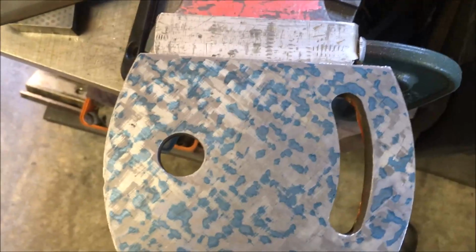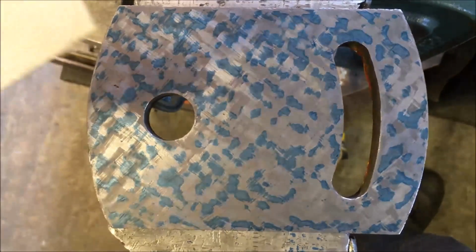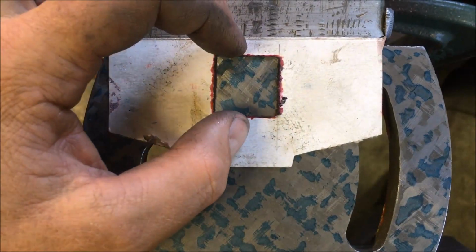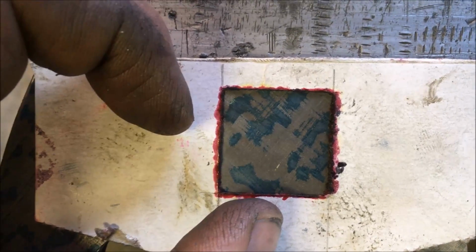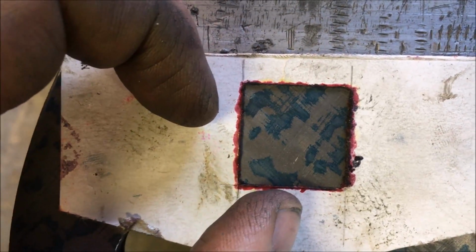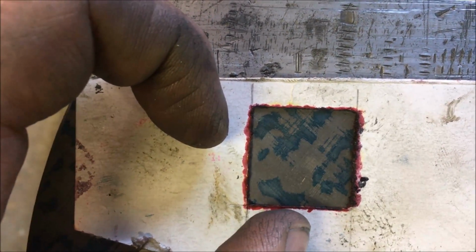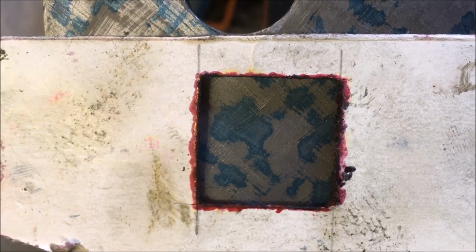Now Emma, you've got to use the right kind of template. I eat muesli, and this is a piece of muesli box. So what we're looking for is around about 10 separate points of contact and about half of it covered in blue ink. So there's less than half covered, and there's 1, 2, 3, 4, 5, 6, maybe 7 there. So it wants a little bit more work yet. Drop it on a dense area, say there. 1, 2, 3, 4, 5, 6, 7.